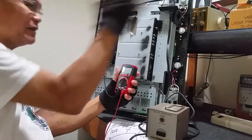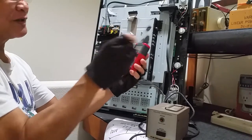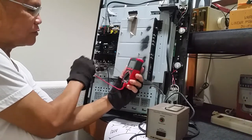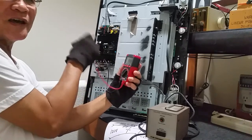You could touch it without any danger. If I want to measure voltage, I will set this to voltage. So if I want to measure the different voltages on the terminals, I could do it safely, because I am on the secondary side — on the cold side.